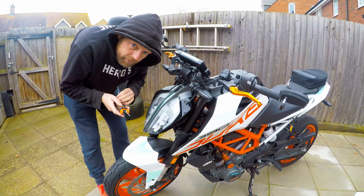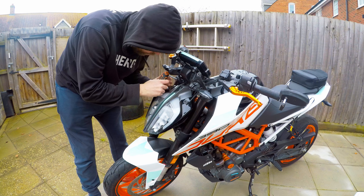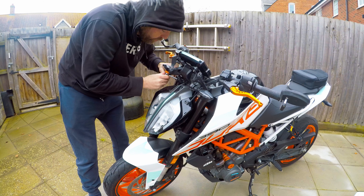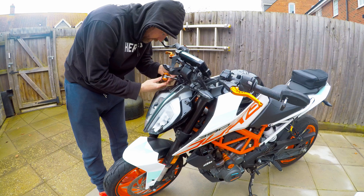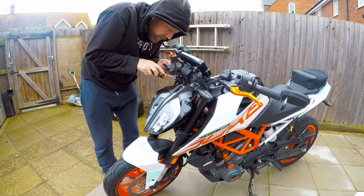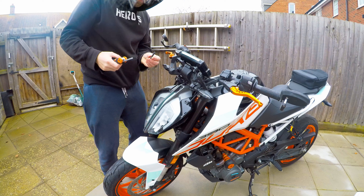I didn't take the bottom one off, did I. Very astute of you people out there in viewer land. Very important tip: when you're putting an allen key into an allen bolt head, make sure that you seat it properly, because if you don't, you can strip it. And trust me, if you strip an allen key head in there, it's a very, very big job to get it out. I speak from experience — I bought a very expensive dive watch and in cleaning it, found the allen bolts were crap and they rounded out. I had to dremel a flathead slot into it to cut it off. Right, let's put that little bugger in.